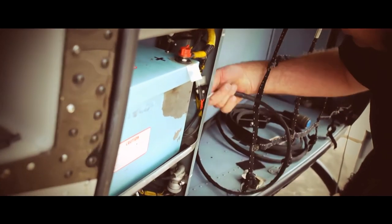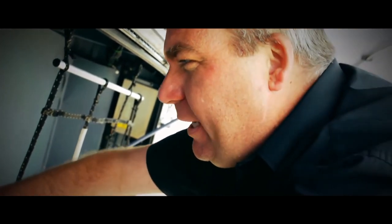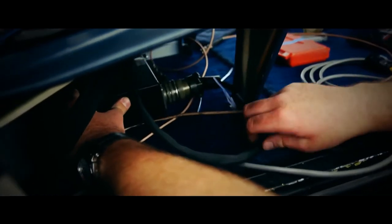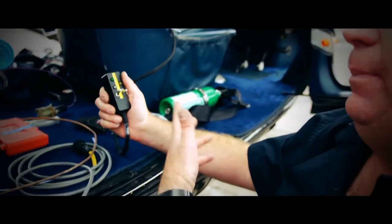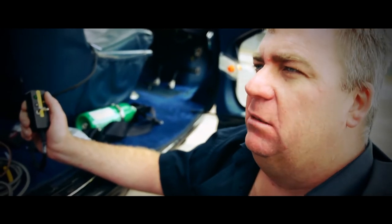These are the batteries for the helicopter — we're wiring straight to the battery. Inside there's a clever little box that we also connect to the generators of the helicopter, so we know when the helicopter is running and has power, and can safely take power from the batteries. We can then give the pilot control to turn the power on and off for all the equipment. If he has any problems, he can just turn our equipment off at any point for safety.